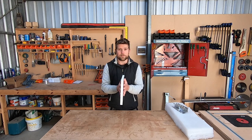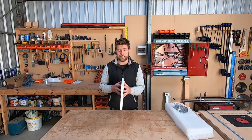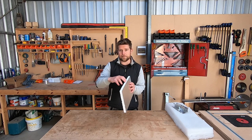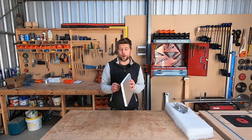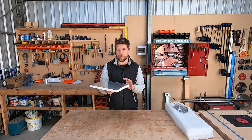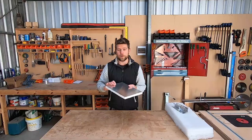The last option I looked at was foil board — EPS covered with two layers of foil on either side. I don't like EPS; it's horrible to work with and terrible for the environment, but I couldn't find a product that suited my needs better. Foil board reflects radiant heat back into the house in winter, and the foam insulation in between negates the cooling effect of the foil. The R-value of the foam also helps insulate, and installing it up underneath the trailer ribs reduces thermal bridging through the steel.